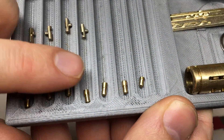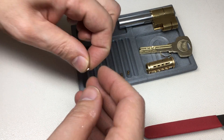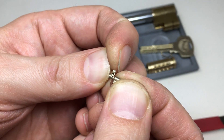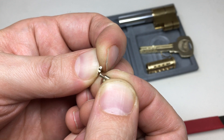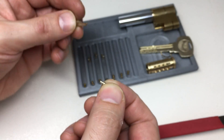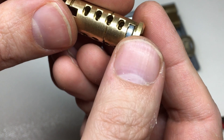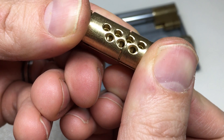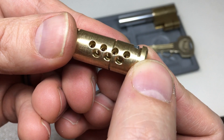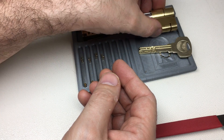The key pins are like little T-pins so they don't fall into the keyway. The sidebar pins are up there and the gating in the sidebar pins lines up with the bottom, and you can see they're quite wide - so you can rake these in quite easily, which is how that tool wiggles the sidebar pins. It's quite a large gap - about 50% tolerance. It does mean the lock will be reliable because it's not going to get stuck, but it does mean it's not made to the highest tolerances. If you look underneath you can see there is some milling to add a little chamfered edge to where the key pins are nestled in, and that of course also means these are slightly easier to pick, although it does make the lock smoother and probably more reliable and less sticky if you're not going to service it.